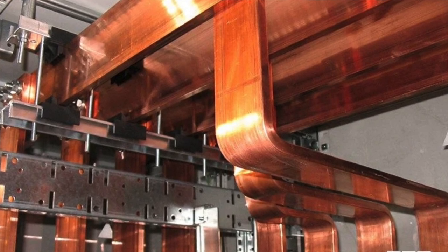On the other side of that drive, they use IGBTs, which are interesting little components. You'll have to look up what those are, because I can't even explain how they use them, but they're basically switches that take that current and put it onto a bus bar system that feeds everything. That current is arranged back into basically AC again, but it's square wave AC. So it's DC pulsed on and off. And then that runs to a bank of thyristors. Thyristors are essentially glorified relays in this case, because every single motor has this 1,000 volt DC bus sitting underneath the thing. But depending on where the train is, it turns on a specific thyristor in that spot.